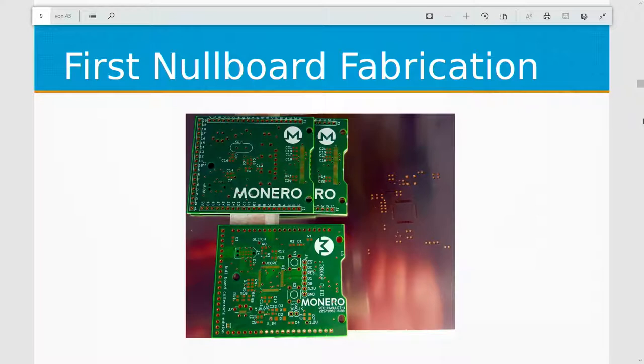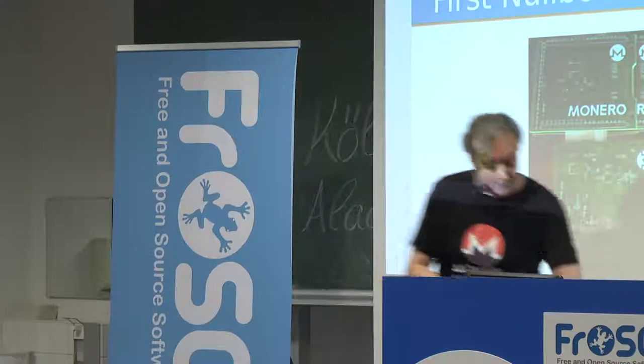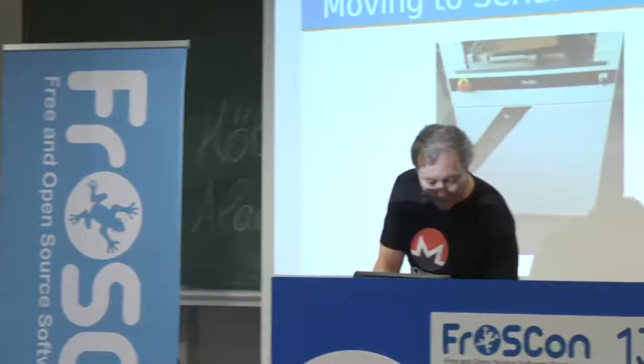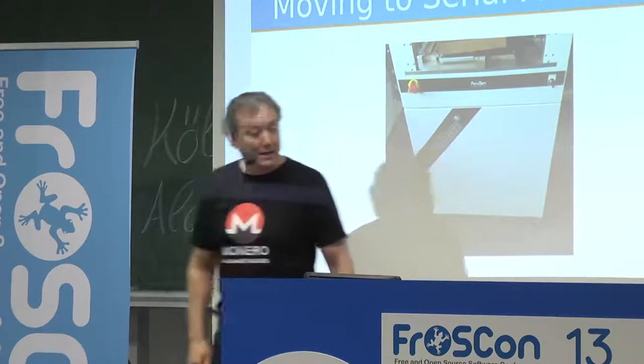And so obviously the solder paste is going only through the holes and lands on all of the pads and contacts in exactly the place where it should belong. That's what a stencil is for. That's what it does in our workflow, in our PCB SMT process, surface mounted technology process.